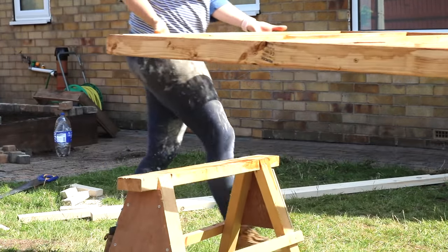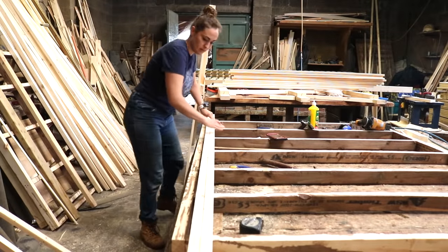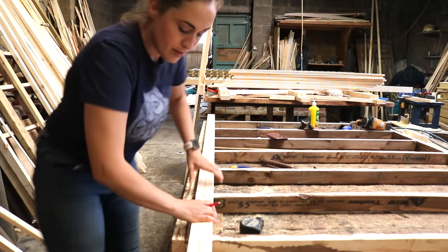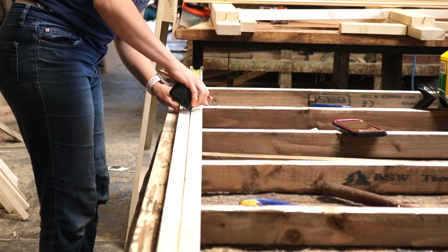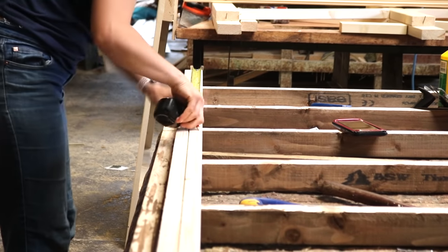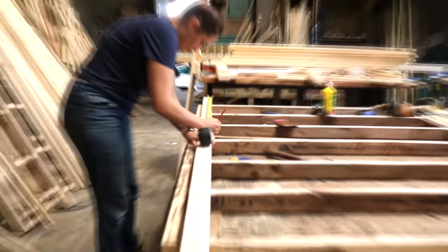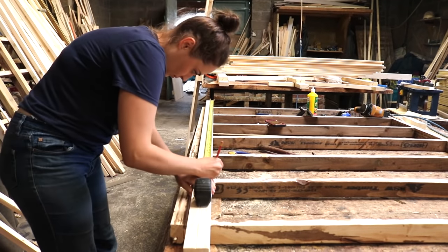After that quick job one Saturday afternoon, I went to my dad's woodyard another day to build the shed itself, but this time with my husband as an assistant. First, I started on building the frame for the only long side we'll need. I held two pieces of timber together — also known as CLS — and these have also been ripped in half, and I'd already marked where I needed to cut them down.